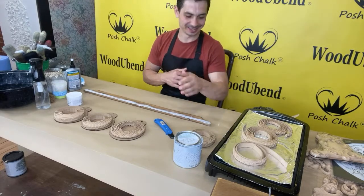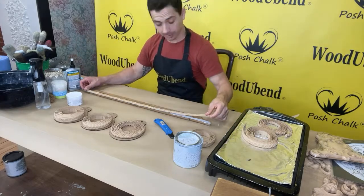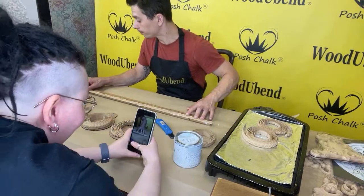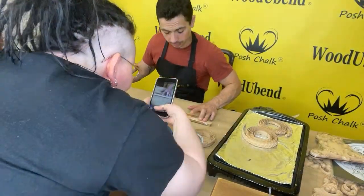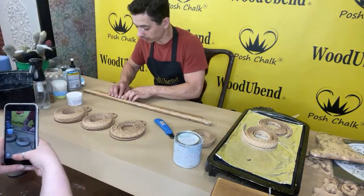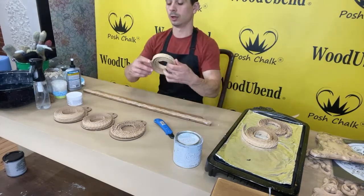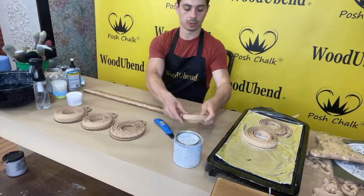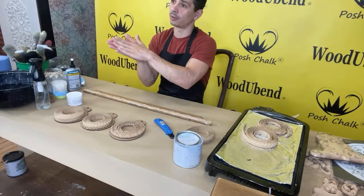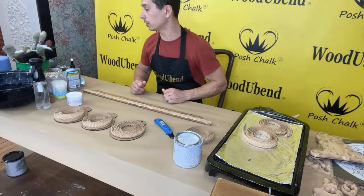Hi everybody. Right, so to apply, so you have exactly the same quality that we do here, all you have to do is to follow 5 easy steps. So you have to warm it up properly. You have to apply the glue on the back so that the back of the molding, the footprint, will be completely covered in glue. And as you can see, you may apply the glue on the back of the molding or the trim or on the surface itself. It's important that the footprint, the back of the molding, should be completely covered with glue and attached to the surface.